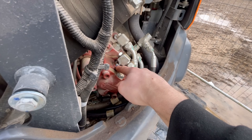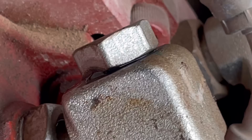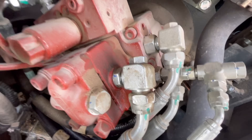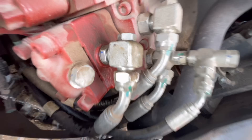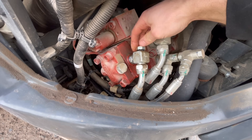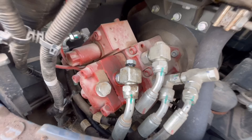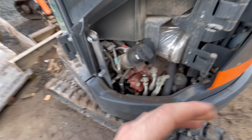At first I thought the leak was down here, but now that I've started it I can see it's coming out of here. That's a nice easy fix. On the DX19 you can actually see the o-ring poking out of its head. What will have happened is that will have come loose — and it is loose. Don't even need a spanner to get that out. There you have it — go and get a quarter o-ring, pop that on, check the oil level. Easy as a peach.